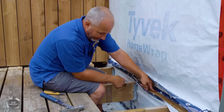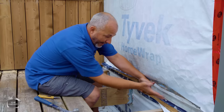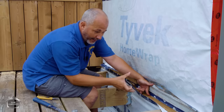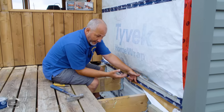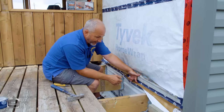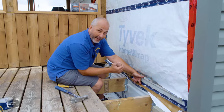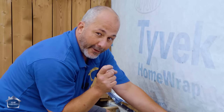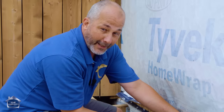Here's the system. If you're installing a new ledger board to a house, you go back to the original part of the house and clean it up. If it's all siding, that means taking a grinder and cutting out the area where the ledger board is going to go. Keep in mind the sizes and adjustments you'll need to reinstate all your siding. If you're going over brick, you're fine — that's the only structure you can attach this to without removing first, because brick is tied to the house. It's already a structural component and you'll be pre-drilling holes in the brick to get all the way into the rim joist.